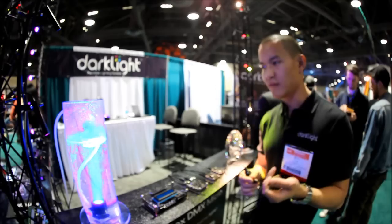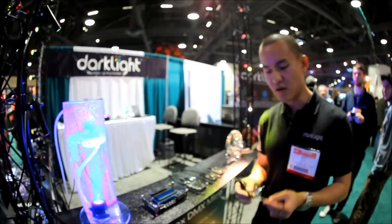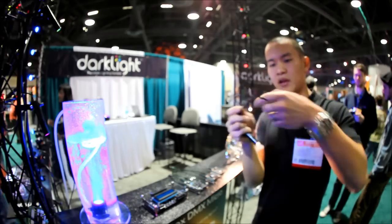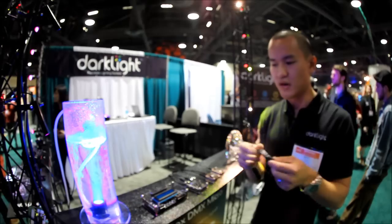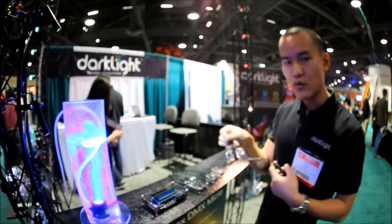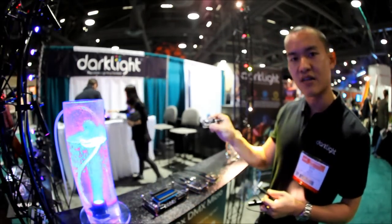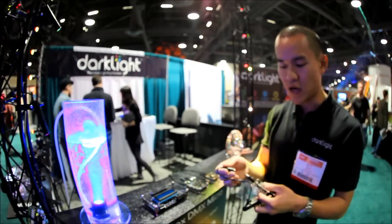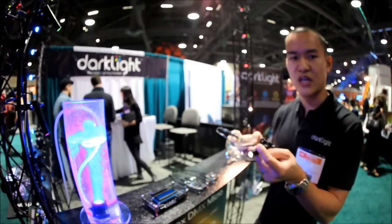Normally we have two types of lights. The DMX light, where the intelligence is fully contained as I showed you earlier. And the other lights we have are simply dummy lights — they plug directly into power. Either a 9-volt battery or a 12-volt power supply will drive these lights just fine, but they simply stay on. If you want to control these lights, we have little controller boxes like this that can go in line between your power and the light, and it will modulate the amount of power that goes into the light so you can change the various modes.